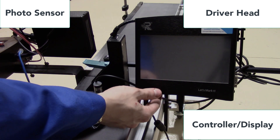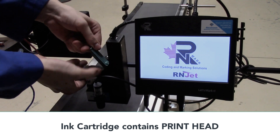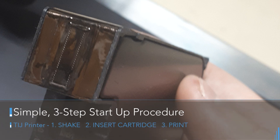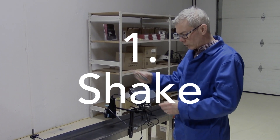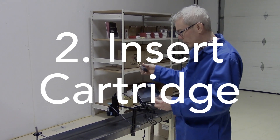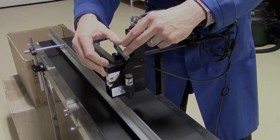What's nice about this TIJ system is the print head is contained within the ink cartridge itself, which can eliminate a lot of potential issues. The maintenance is a simple three-step system — in this case we shake, we insert the cartridge, and then we print. So we give the cartridge a shake, remove the cap, insert the cartridge, go into print mode, click that down, and you print.